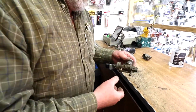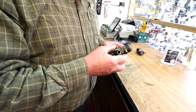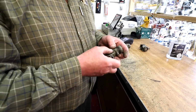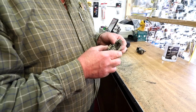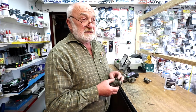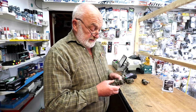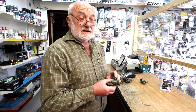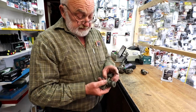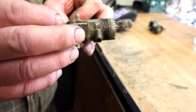Absolutely crazy stuff. Then late 60s, early 70s, I got into IC cars, and Keith Plested's famous saying was, it doesn't matter what motor you use because you're never going to be able to put the power down from either an OS 19 or an Enya 19. So what I did was I bunged up the carburettor and put disc induction on the back.